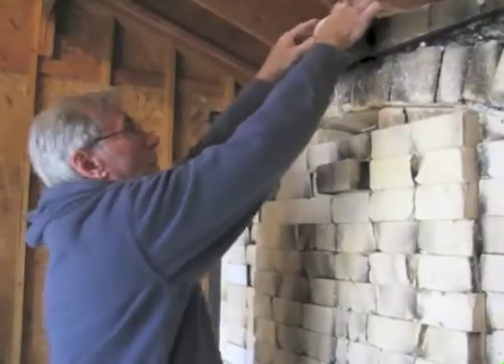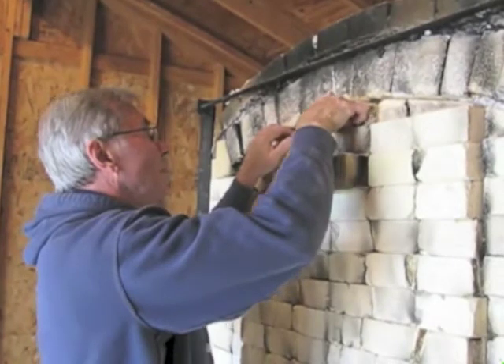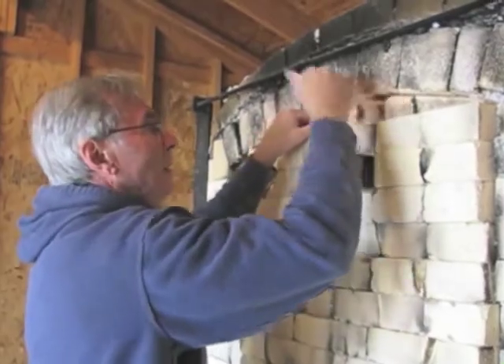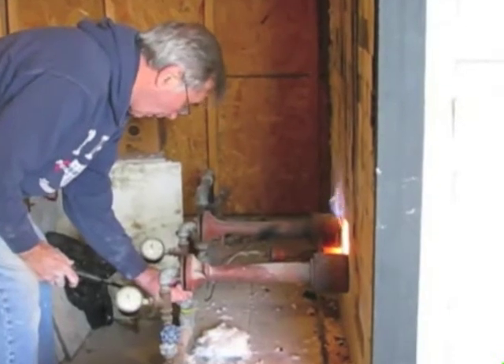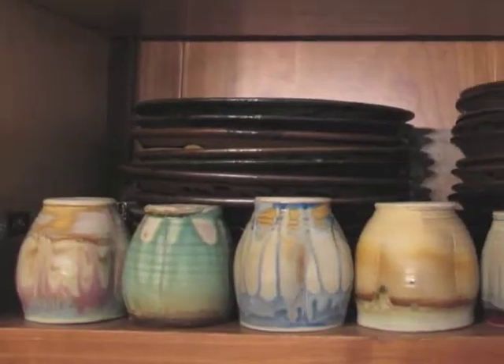And after the loading, I brick up the kiln. I made this kiln. There's no mortar in it. It's all held together by gravity. Light the burners and then gradually adjust the fire upward until it reaches 2,300 degrees Fahrenheit, which will melt steel but also make stoneware. And that's what you're looking at now.